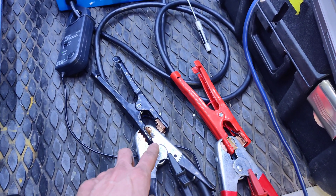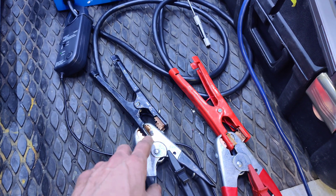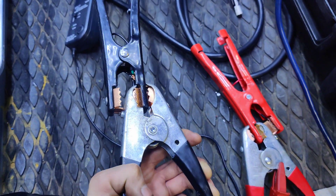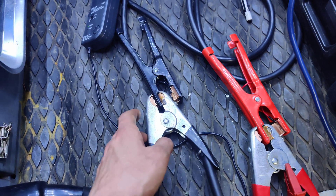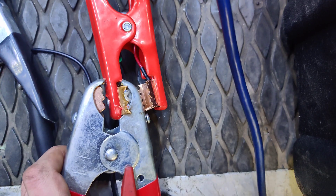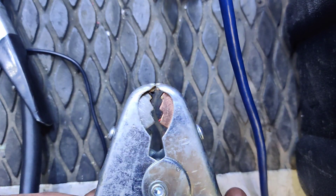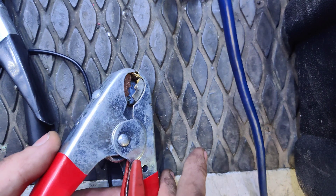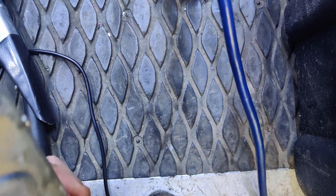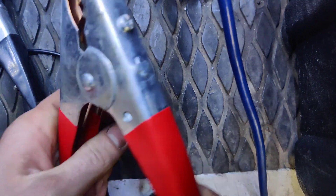Someone had mentioned this — I'm also going to make a jumper wire that goes from one side of the copper to the other side of the clamp, so you get power going to both jaws rather than just through one. Right now all the power goes through one jaw, which causes the clamps to get pretty hot and discolor. These clamps are soldered and crimped, but I think we're just getting too much voltage drop there. I might get some heavier clamps too.